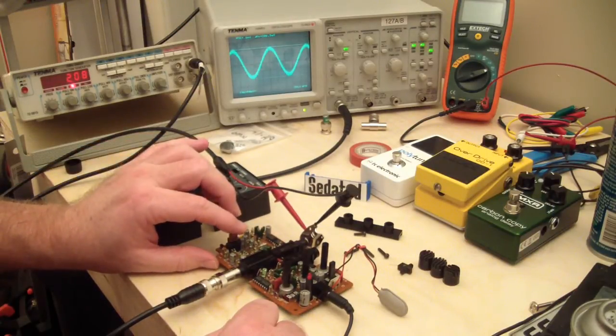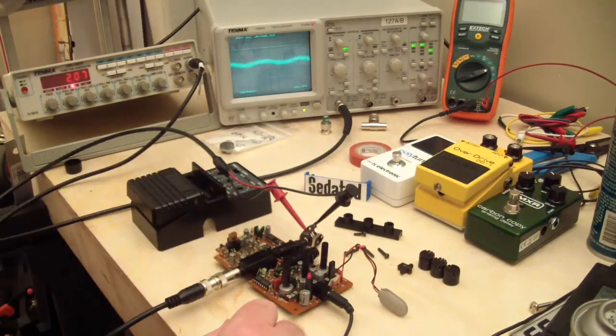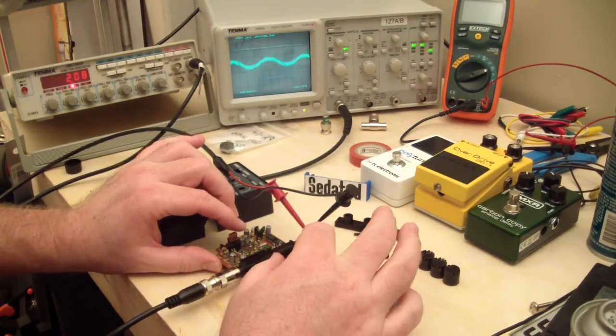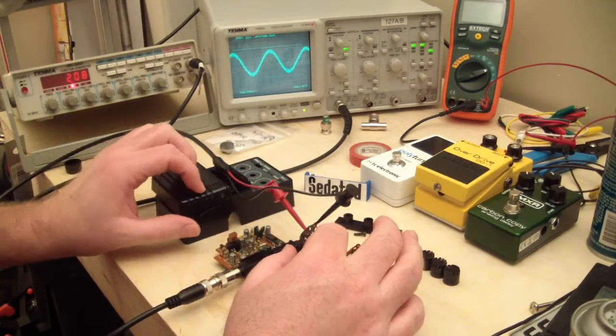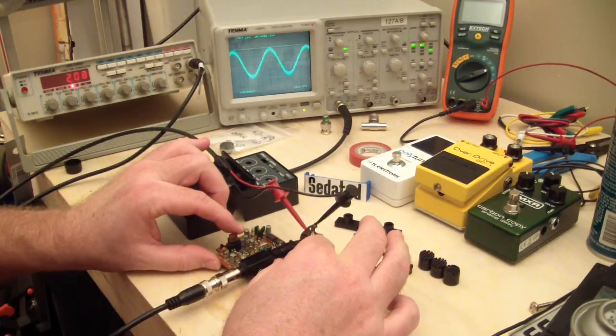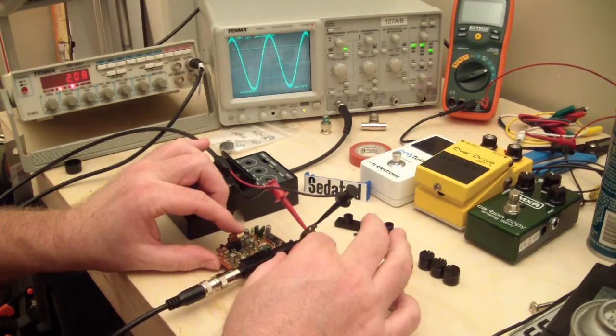And if I go ahead and turn this on, you can see the classic output of the chorus. All the knobs are on 0. They're all turned down right now. And I'll bring up the aforementioned tone knob, which is causing all the trouble. And you'll be able to see that it acts as basically an amplitude knob. You can see it's fine. It goes up in a nice taper with no noise or anything.